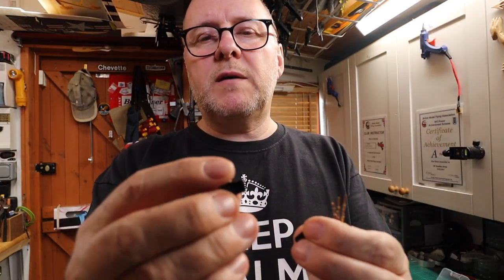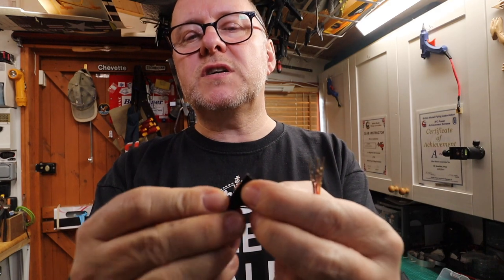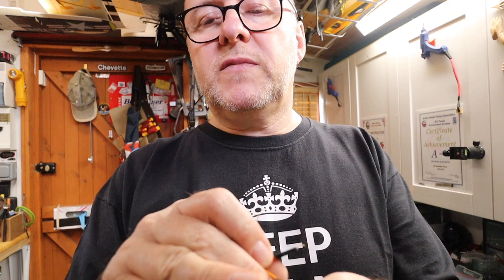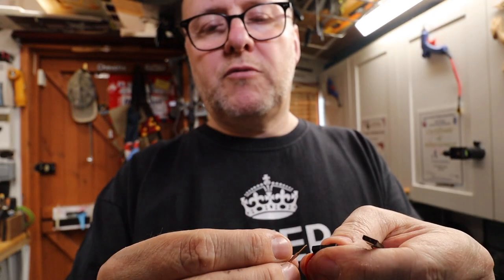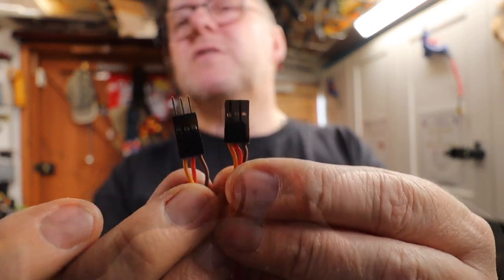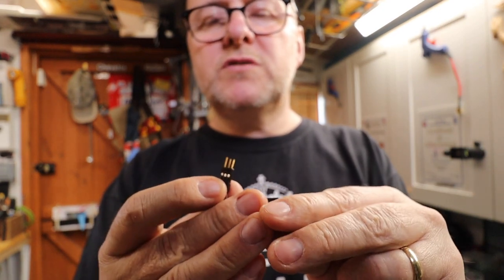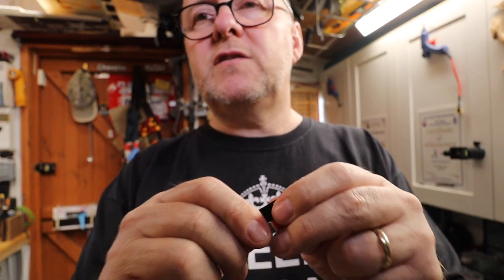Now because I'm doing the male plug, it comes with a standard female plug which is the same as that end, and then it comes with a shroud to make it into a male end. So you need to know which way they go in — it'll only lock in one way. I know the red is in the middle so I can put the red in the middle and pull it into place and it actually locks in. The orange is on the left, so I put the orange on the left and the brown on the right. Now it's the same as the other but obviously the male version, and then to finish it off there's a shroud that clips on. These are a bit tricky because they only go on one way.